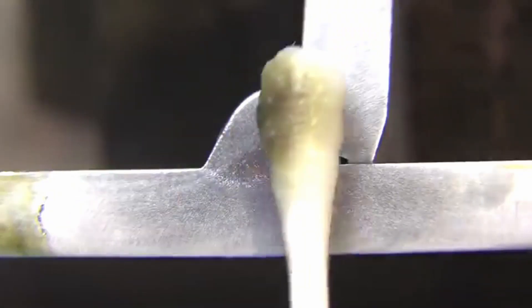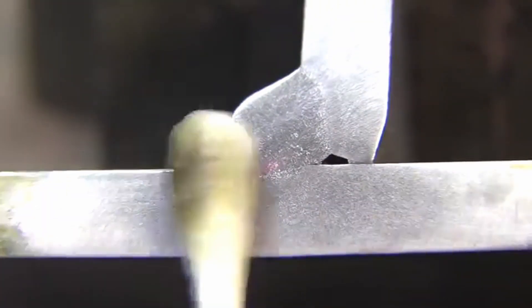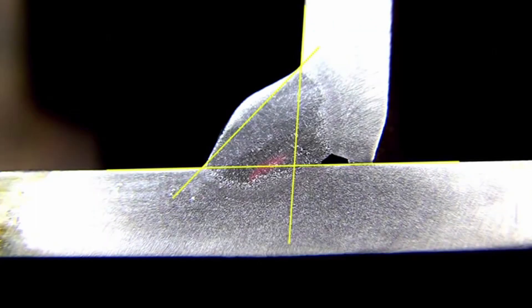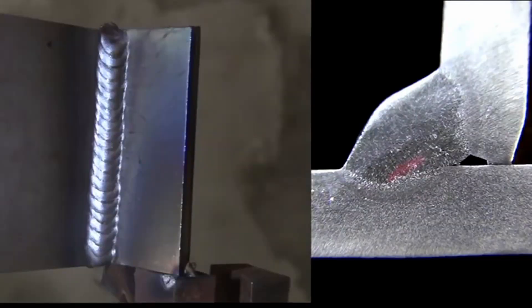A quick swab etch here, and other than a rough shear cut and a little bit of a bad fit-up, you can see it punched in there pretty far past the intersection where the root is. Got a little convexity — you'll always have that on vertical uphill — but the main thing is it got in there and it was controllable. I also did one where I bumped the setting down one thickness and it was okay too, just a little more crown, more convexity. If you could stand that, you might just want to do that.